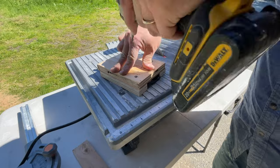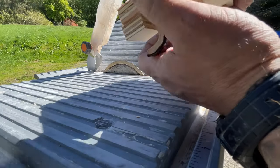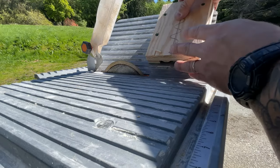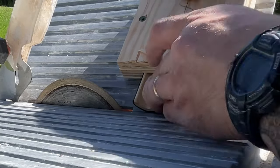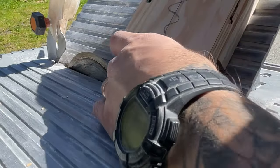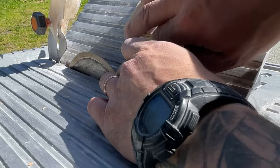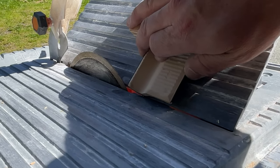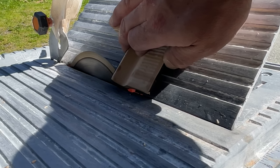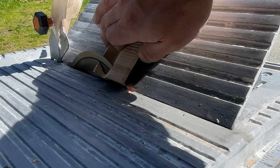What this does is it allows the tile to sit flat inside the cradle upside down. If you didn't have this cradle, it would be incredibly difficult to get your tile to sit level on the wet saw in order to do a 45-degree cut. It was a little difficult to get the tile to sit in there straight, so I had to hold it up against the cradle and slide it along that edge.